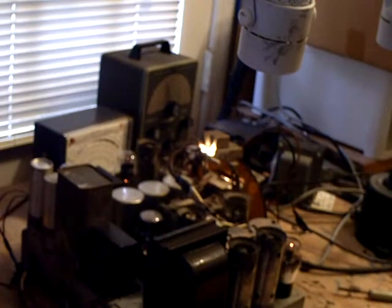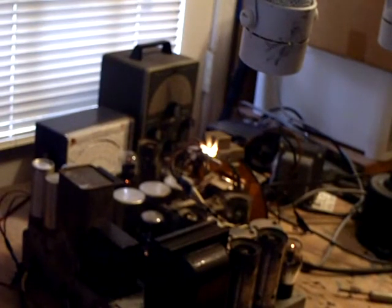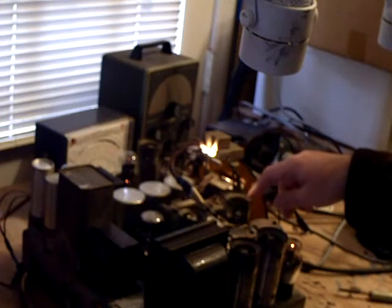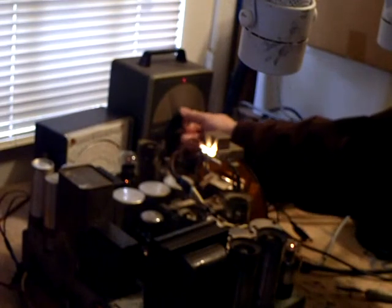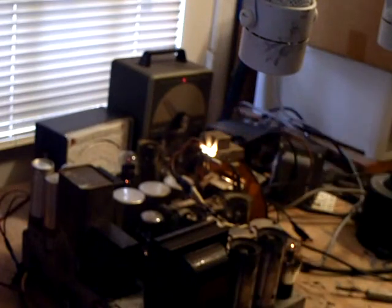To make a long story short, I checked the resistors again and they were good — I thought maybe a resistor was breaking down under load. The resistors in the oscillator circuit were good. What it was is that I didn't align the radio correctly. I'll leave it on just in case it starts popping. The alignment procedure is pretty involved — it involves setting the signal generator to 3.6 megahertz, aligning band four first, setting the dial to 10.8 megahertz, and picking up the third harmonic.